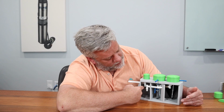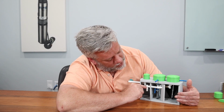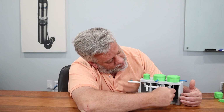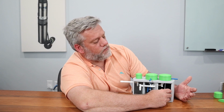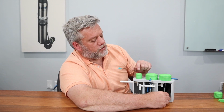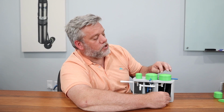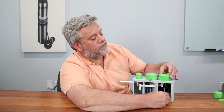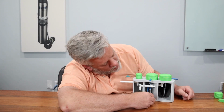Their trash tank, it comes in here, and then the pipe is actually over here, and it goes out and it goes into this tank, and your aerobic chamber's at the end. So that's something you'll want to be mindful of. On your ClearStreams and all systems, there should be a placard, and it's riveted in there, and it'll tell you the model number. So that's one way. A lot of people are like, I have an aerobic system. What type? One of the ways to find that out is there'll be something that is riveted into the top, and that'll tell you the manufacturer's name, or it'll be on the control panel.